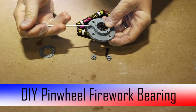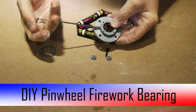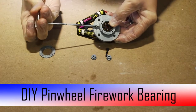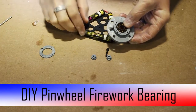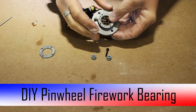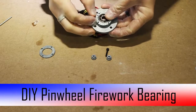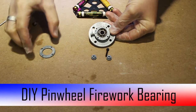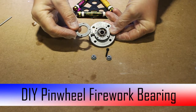Now in theory, we shouldn't have a whole lot of force on this thing. The problem is going to come not so much from the force, but from the vibrations. As this thing spins, these aren't particularly well balanced as I'm sure you can imagine. So we want to just go ahead and lock that down. Depending on your level of comfort, you can go ahead and leave it there, or there is this retaining ring that will also help out.